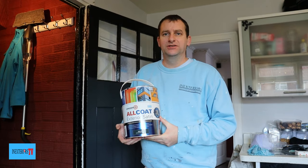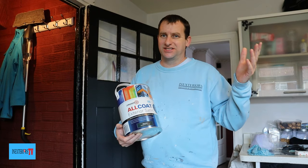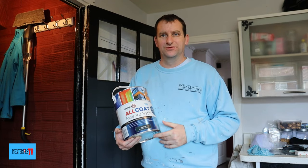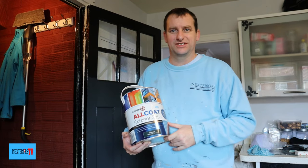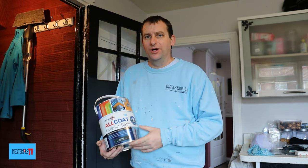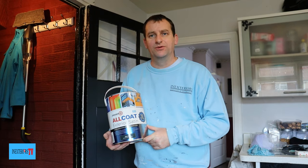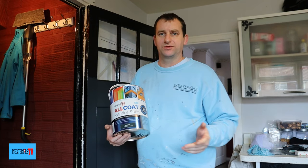It says it's recoatable after an hour, but I'd say that's down to your temperature, do you know what I mean? The colder it is, the longer it's going to take to dry. It won't cover damp patches and go over knots, because the knots will still bleed through.